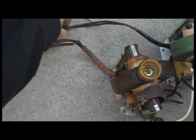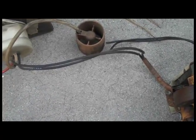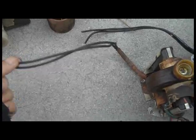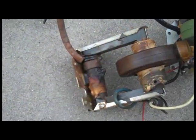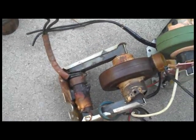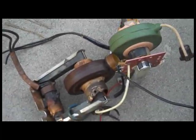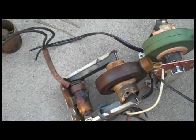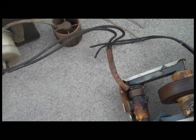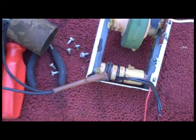These leads carry the 26,000 volts that runs on the picture tube anode, so this cannot be botched. The filament tap is only two turns on the bottom of the transformer. The plan is to remove the RCA filament lead and transplant it onto the Packard Bell flyback. There may be other lead length issues that won't be apparent until deeper into the job, but this is the first priority.